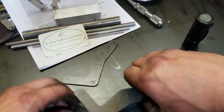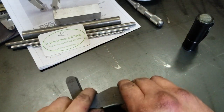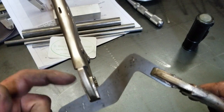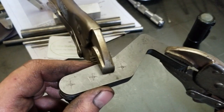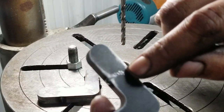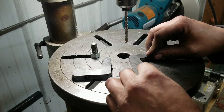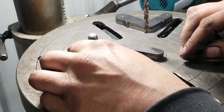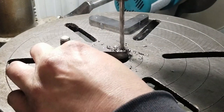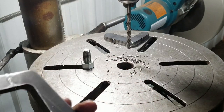What we're gonna do now is clamp these together really, really snugly and accurately, hopefully a little bit closer — you know, not inaccurate. Then I'm gonna put a couple little tack weld beads on there just to hold them all together. This is actually probably the flattest surface in this whole shop. If you do get a little bit of glob weld under there, you're gonna have to file that flat so that everything stays flat. I also put a little bolt here just to ensure nothing crazy happens.